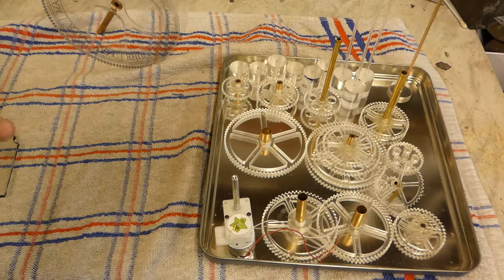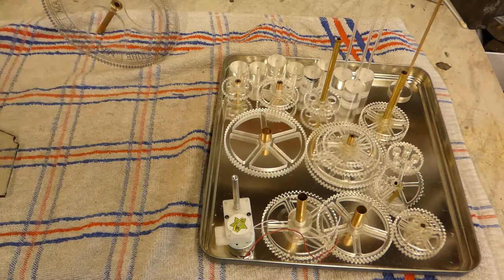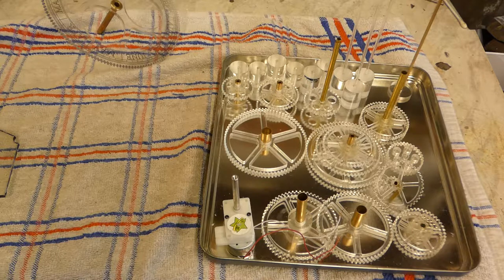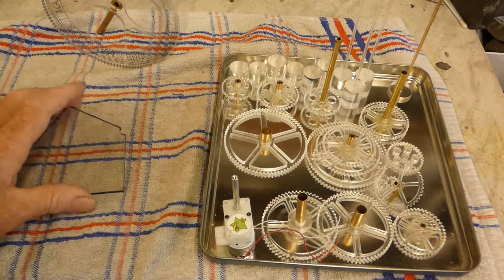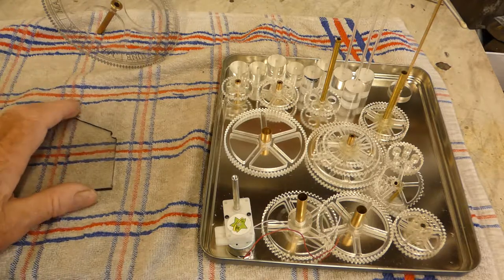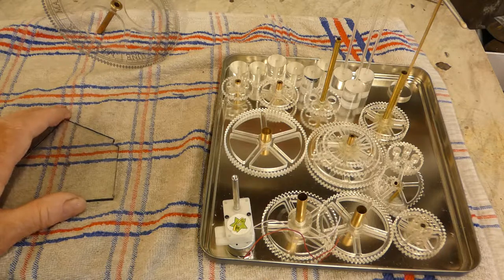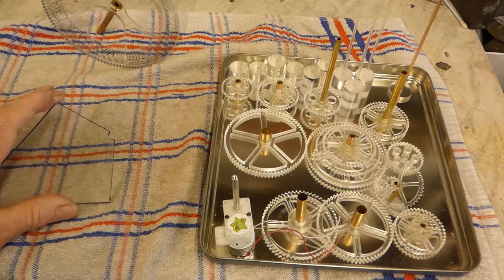I came up with this one — Magic Weld, a UK supplier. The chemical is dichloromethane, also known as methylene chloride, and that's brilliant. What it does is it sort of half-dissolves the plastic, makes it soft, and when you press the two pieces together the adhesive evaporates and the two lots of plastic harden and join together — it becomes more of a weld. And that is extremely good, works very well.